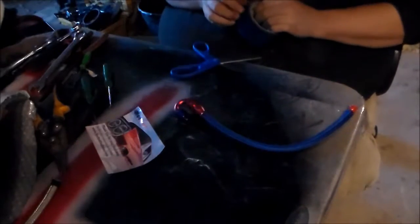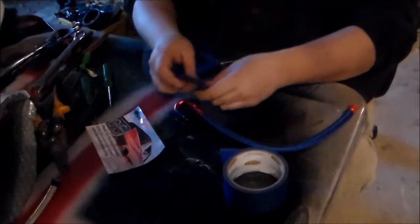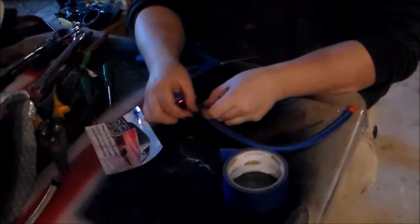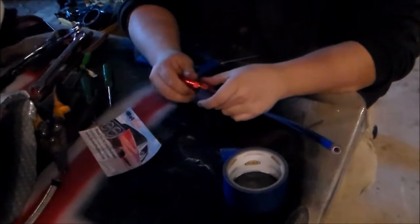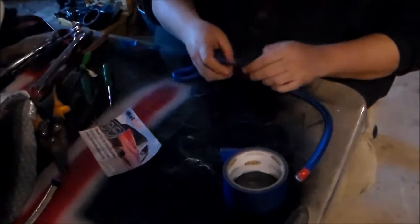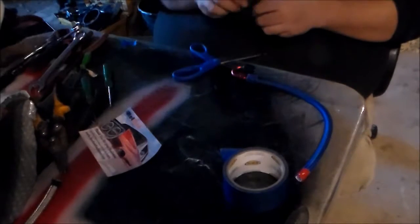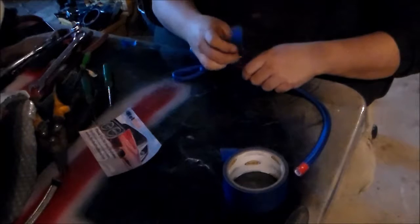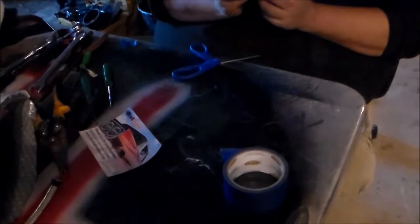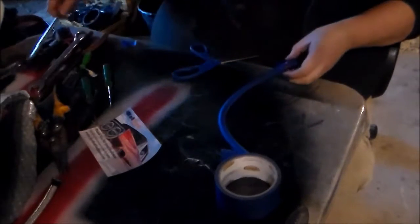Now you're basically done. So I don't mar or scratch it up, I'm going to put some tape on it. You don't have to tape it — I just do because I'm super particular about the look. Trying to do everything nice and clean. Just one layer of tape on both sides of both the 90 and the ferrule side. Make sure it's not going to get in your threads. Just make sure you don't have any tape in the thread area. Now you can use two wrenches, or if you have a vise you can put it in the vise and lock it down.